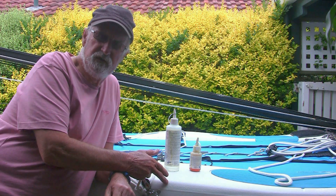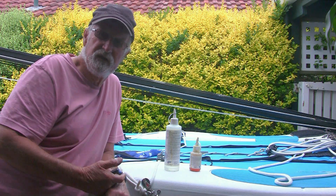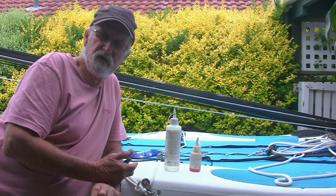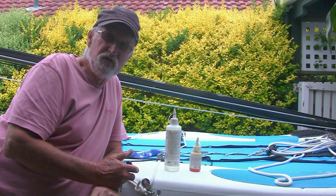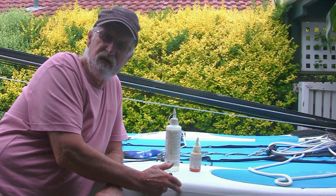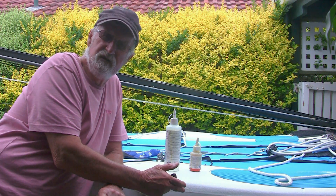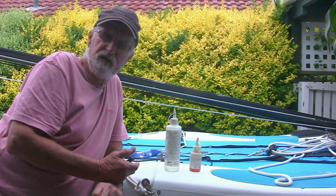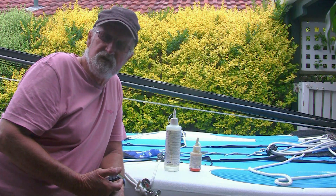If you've got water getting into your hull, you know that you've got a crack somewhere. If you find a crack that is really hard to get to, you're going to have to fix it right through from one side to the other to give you a bit of strength. One way to get the epoxy into the hole is to actually remove some of the air using your hose method through the bung at the back — put some epoxy in the crack, suck a bit of air out, and watch as the epoxy gets sucked into the hole. Once you've got a reasonable amount sucked in, release the pressure and the epoxy with its bit of baby powder will stay in that crack and seal it up.